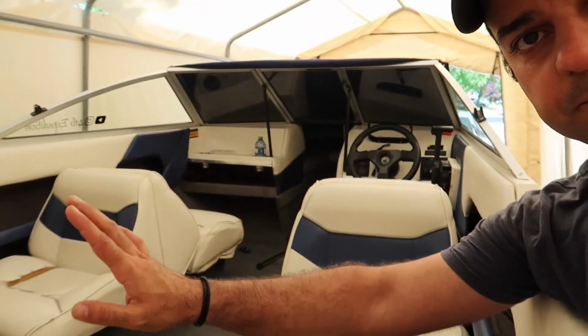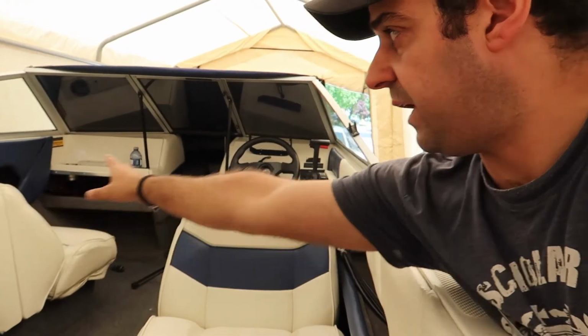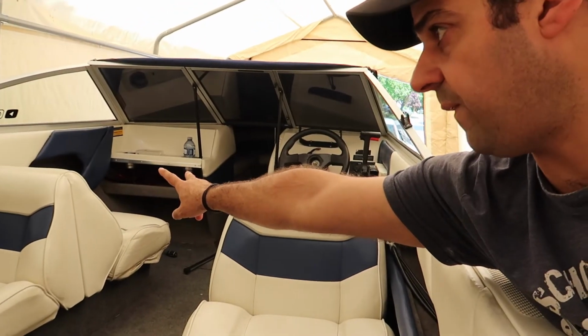But it really worked. And what was kind of lucky for me is that I'm actually starting the install for the radio. So what I did was I put another fuse panel back inside here, a 6-fuse block. Because of that, I'm able to run a separate power source to that side and still be able to use the switch on this side, because I wired it into the relay. So that side, this panel, and those two cup holders are on that relay.